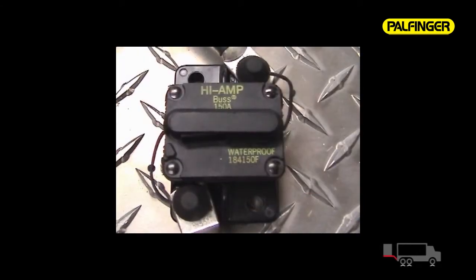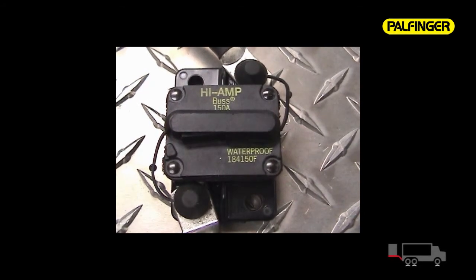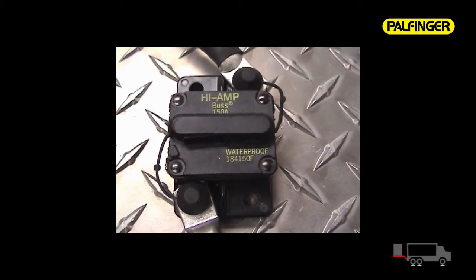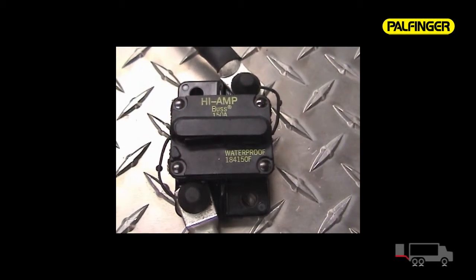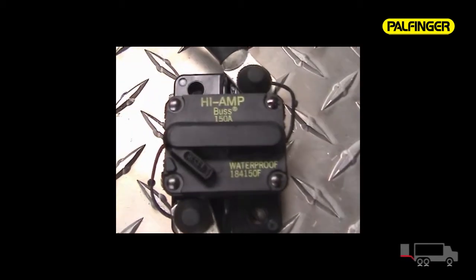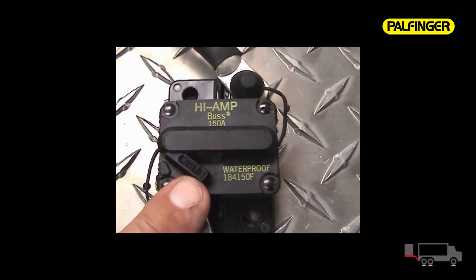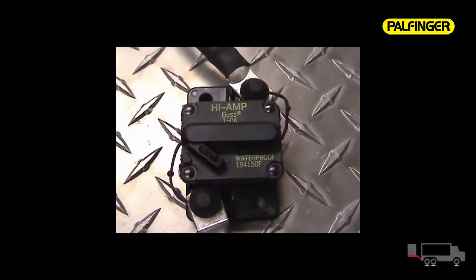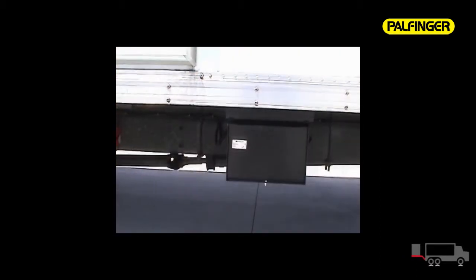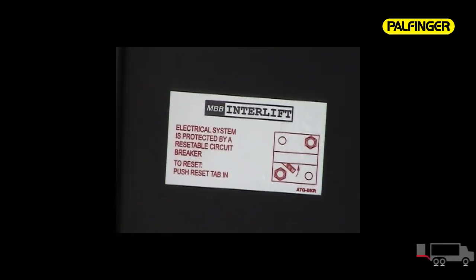One of the most vital components of protecting your ILT is the 150-amp circuit breaker. This protects your liftgate from direct electrical shorts, extended operation with low battery voltage, and other safety and equipment-damaging conditions. When tripped, a spring-loaded arm pops out indicating an overload. It is easily reset with no special tools or advanced mechanical knowledge by simply pushing in the arm. Always maintain and replace missing or damaged circuit breaker decals so they are accessible to any operator.